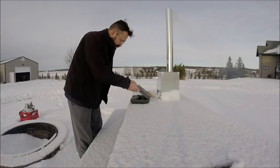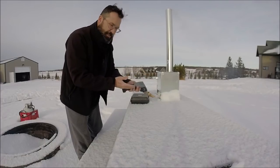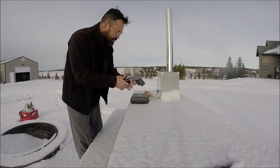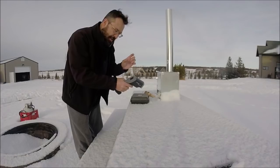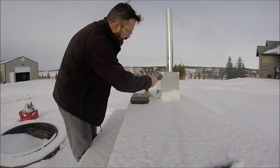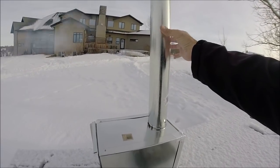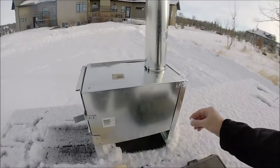Now, no engineer in the oil patch should be without a temperature gun, so I have a temperature gun. I used to use this in the good old days to measure reciprocating compressors. If you measure the temperature of the compression valves, and a lot of pieces of equipment, you can diagnose equipment. Thermodynamically, when you're compressing a gas, there's an expected temperature, and if the temperature is not exactly correct based on the compression ratio, then you have a faulty valve. But with this, without getting scientific, I can tell you that's hot. That's very hot. Well, here, let's do a scientific experiment.